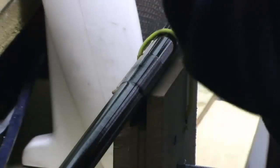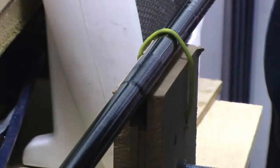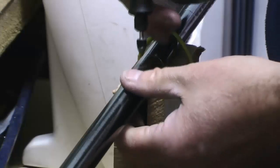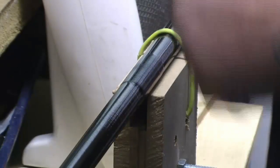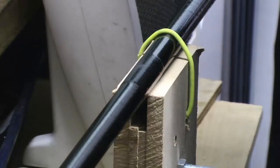Okay, I'm going to take the drill bit out. Unfortunately with this Dremel that means changing the chuck over. Okay, that's now tightened in place. So what we're going to do now is, with the grinding point, I'm simply going to use the pilot hole, as you can see that will slot into it, as a start point, and I'm just going to go down straight through into the pole kit. And I'm going to be very careful that I don't go all the way through and touch the far side of the pole, like this.